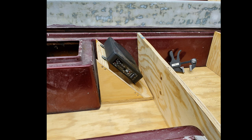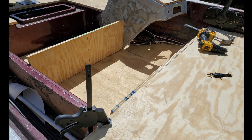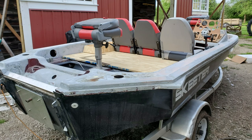With the framing of the bow locker roughed in, you can start to see the makings of a more conventional modern layout that has continuous flat floors forward and aft, and a footwell in the midship area. This allows for three-across seating when you're underway, and the jump seats are easily removable if I choose to reconfigure them in the future. On the port side, I framed up what would become an armrest compartment with integral storage that also doubles as a step to the aft casting deck.